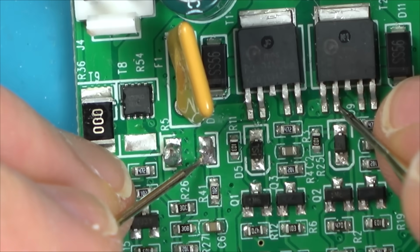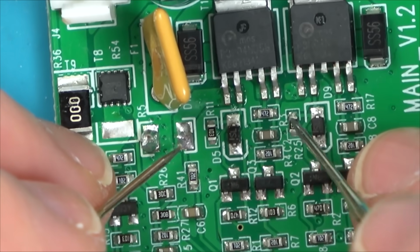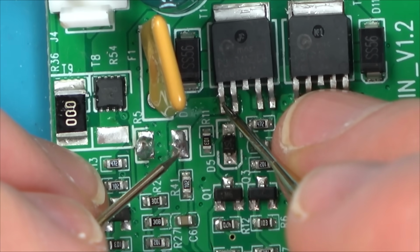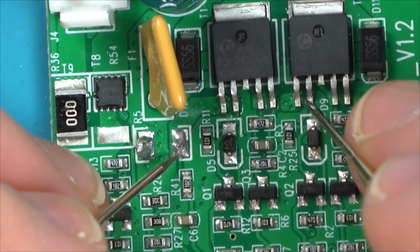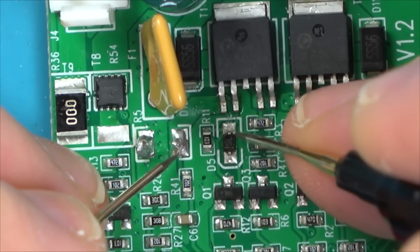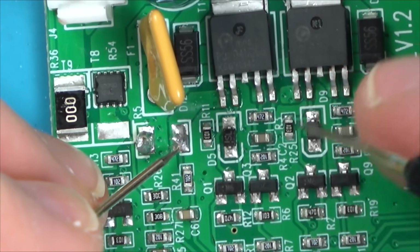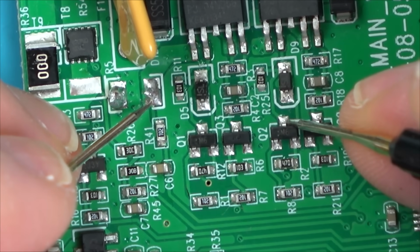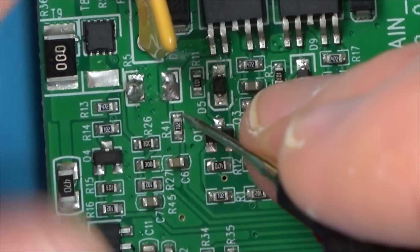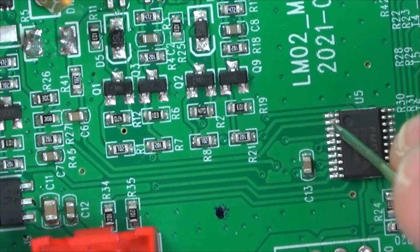Oh, hold on. Well, it shouldn't be coming up there, because it's not coming up here, and these are identical. Can you see all the components are the same? So, hold on now. There. There. There, but not here. Right, this is different. Because basically from here it goes through here. This is measuring correct here, and then it goes into this microcontroller on that pin there.